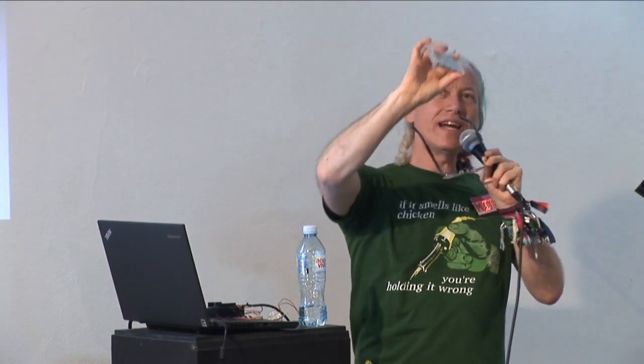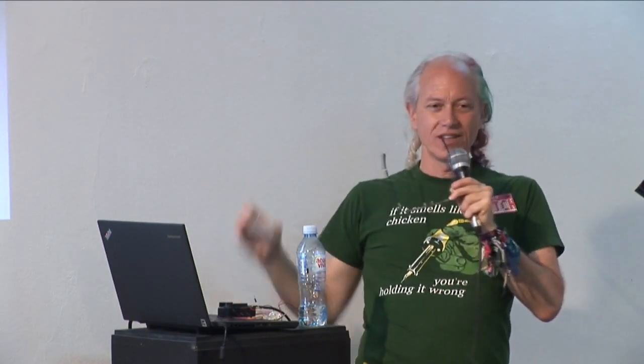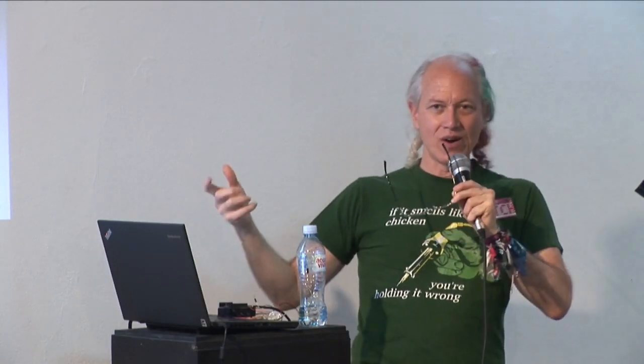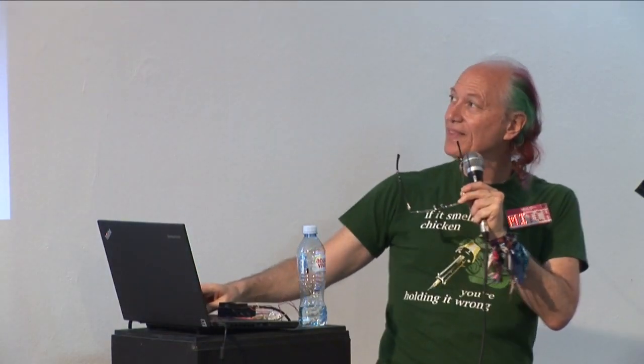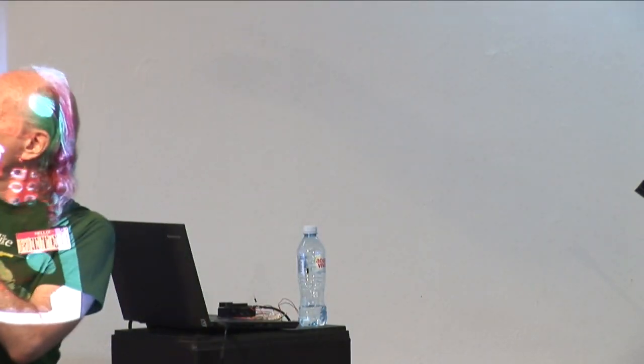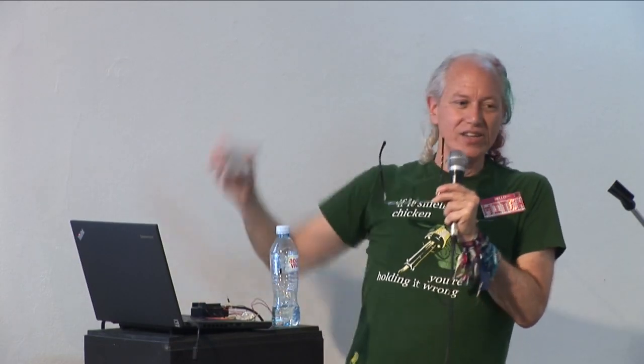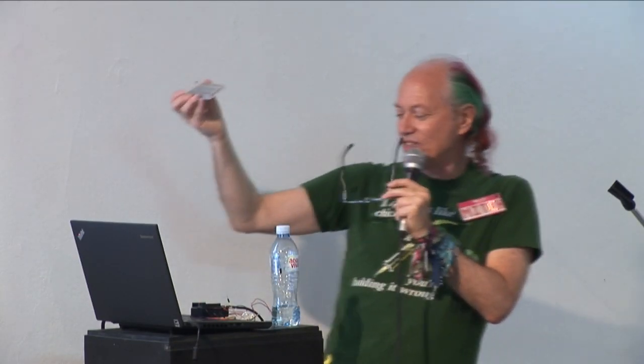And then I can connect wires from the Diavolino, pin D13 and ground, the same pins I used before. If I take wires from here, D13 to the long lead through a wire to my solderless breadboard, and ground through a wire to the short lead of my LED on the board, then the LED will blink on the board. So here's what I do. Now you don't have all the parts for doing this, but I do, so let me just do this.